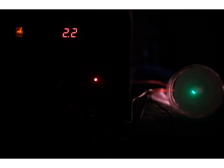Now we're at 2.2 kilovolts, which is way below the lowest voltage the tube is designed to operate at. At this voltage, I can just barely see the inner m equals 1 ring and get data. The outer one is too dim for me to see, and this is about the lowest data point we're going to get. You can also see that the central spot is a little bit rectangular at this voltage. I'm not sure why, but basically the beam focusing is probably not designed to do anything sensible at this low voltage. So even though you only have 1 ring, you can still get data here that tells you what the wavelength of these electrons is.